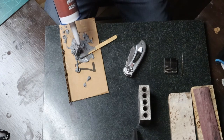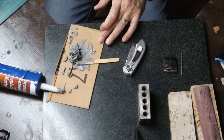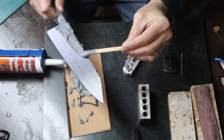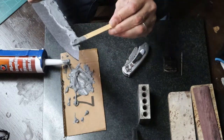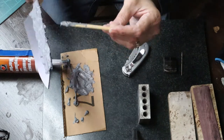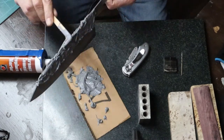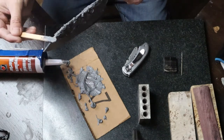You do need to get it on there and let it dry for at least 24 hours so that it's dry to the touch. Because when you apply heat to this, the moisture inside that clay starts to want to evaporate. And what it does is it makes the clay swell and you get pockets, which is what I did. I only let this set up for about 6 hours and I thought it was dry enough. And without using a heat gun to continue that drying process, I just went ahead and started my quench cycle.